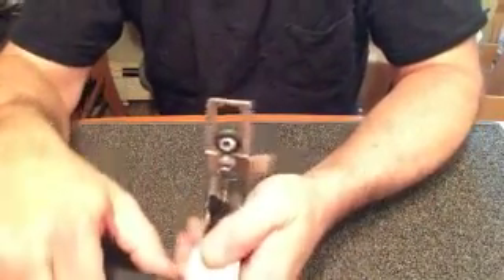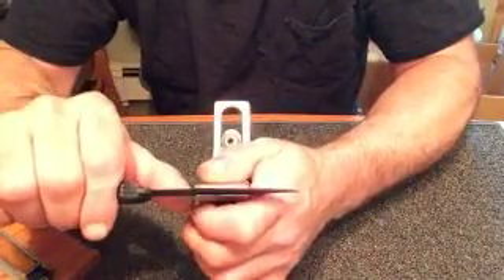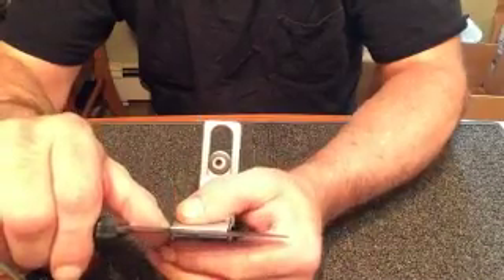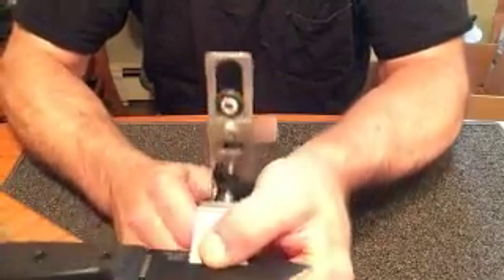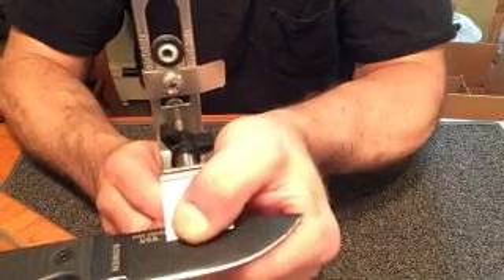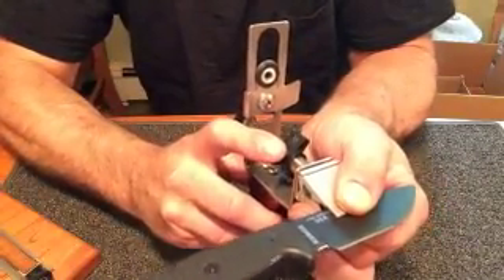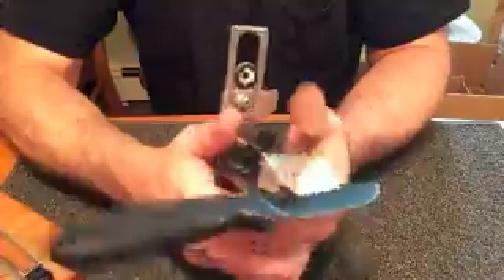Loosen the jaws, put your knife in. You want to be looking straight down on your knife. I'm wiggling it around and lining up my back line, whatever reference point I decide to use, and getting it where I want it. Then pinch hard, right at the front edge. This is a full flat grind, but those jaws are now conforming to the shape of that full flat. So we pinch, snug, drop your hand back so the clamp doesn't rotate, and give it that last tighten.